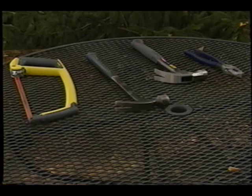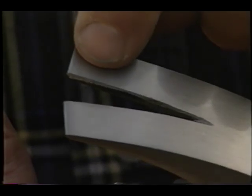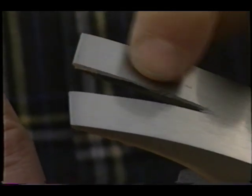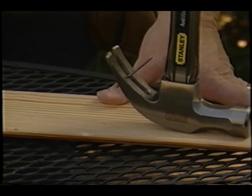There are two or three really easy ways to get those finished nails out without having to damage the wood, and you're going to do it from the backside. The first thing you should use is a hammer. You want to get a newer hammer because the hammerheads have really nice machined edges at the claw end, and they will grab onto the nail. You slide it down pretty rapidly, it grabs on, and you just pull the nail backwards out through the wood. That's really an effective way.